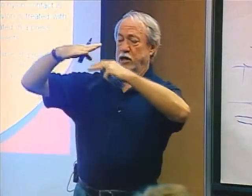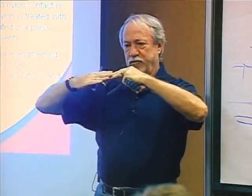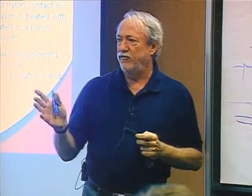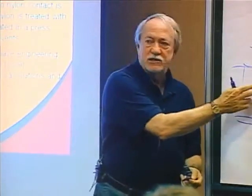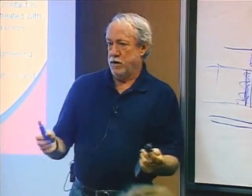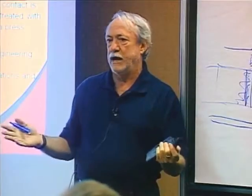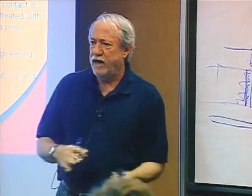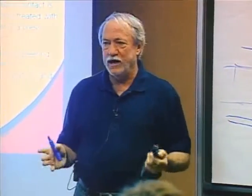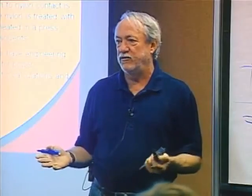If you use too much and you put it together and you put it in a press, you get that thing wanting to push away from itself or turn sideways. If somebody is having trouble in the field with splices on nylon core in particular, go look at their equipment and look at their press. They'll have a waffle iron style of press somewhere in that plant. If there's glue all over that or catalyst all over that, they are for sure using way too much. You know exactly what the problem is when it comes to their splicing.